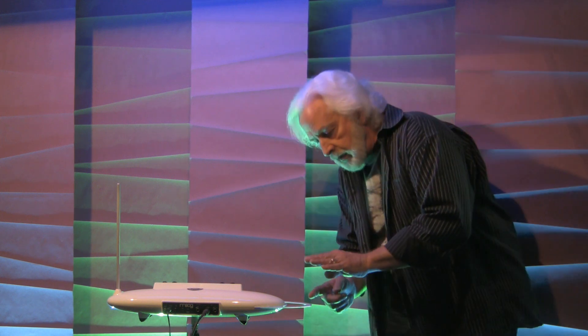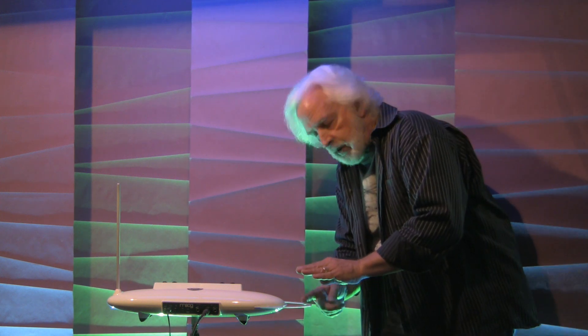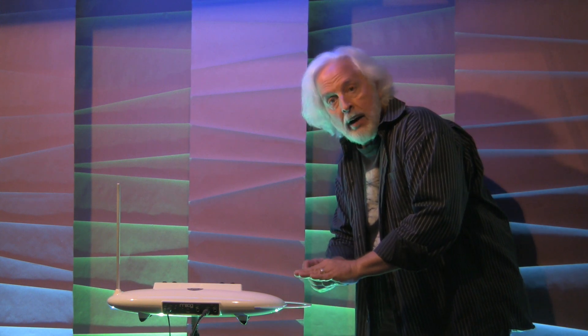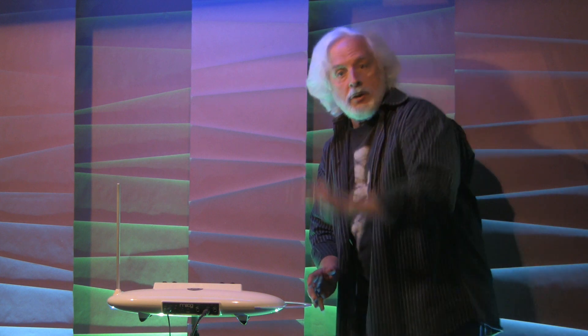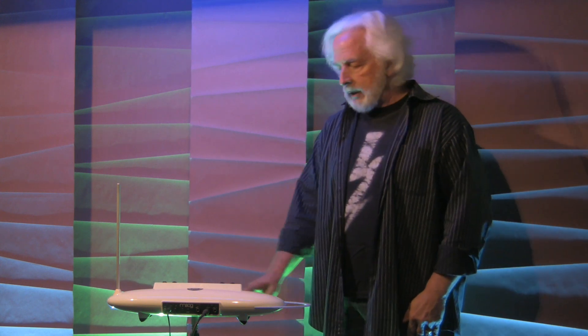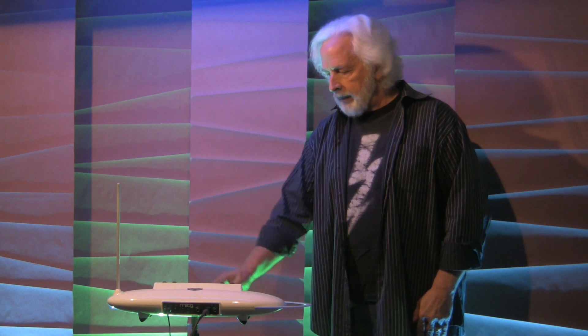So if you're ready, let's set where the difference between silence and sound is going to be. It will be silent until about two inches — that's where your volume is going to kick in. It says press setup then hold your hand near the volume antenna. Remember: press setup, let go, do not make the adjustment until after you've let go of the setup button. I press setup and hold my hand two inches from the volume loop. It counts down and now we're ready to set the highest point.